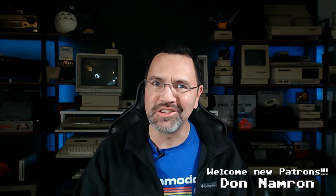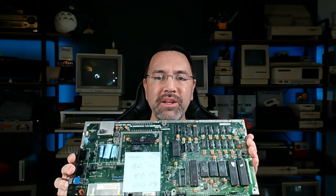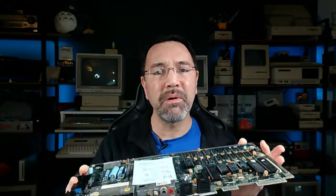Repairing a broken Commodore 64 is a YouTube rite of passage. And I made my first attempt last week during a live stream with the help from many of you guys in chat. Now, it's probably not the smartest thing to attempt my first repair live, and I messed up a bunch of times along the way, but we got there together in the end, and we were able to fix this disembodied longboard that had multiple failures, including a dead 6510 CPU, a dead PLA, and a bunch of oxidized sockets.